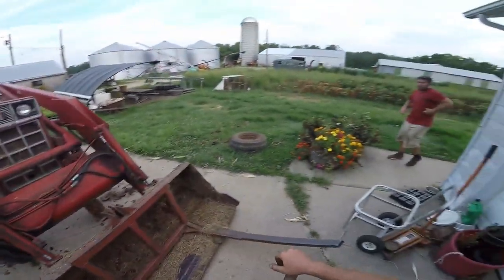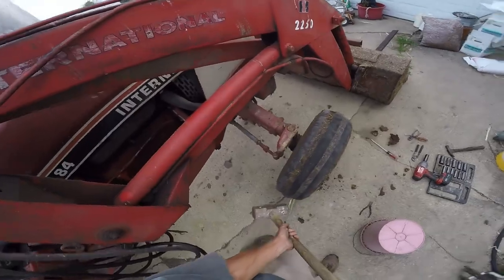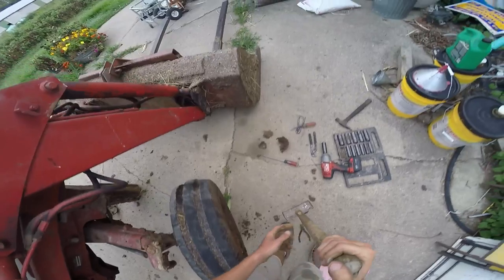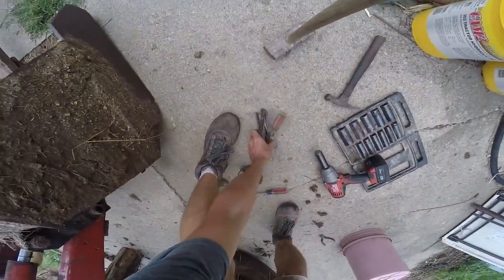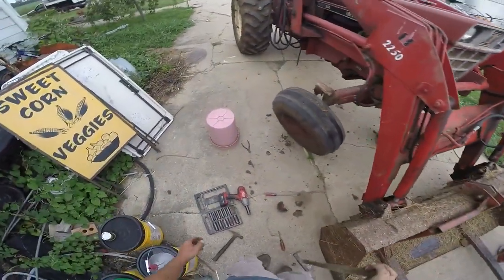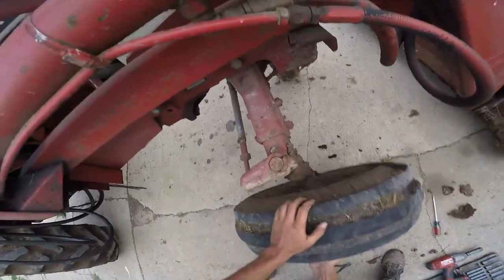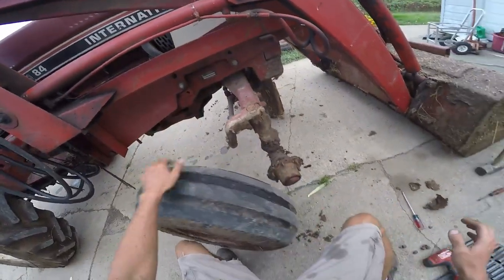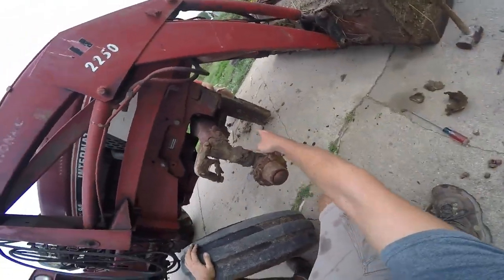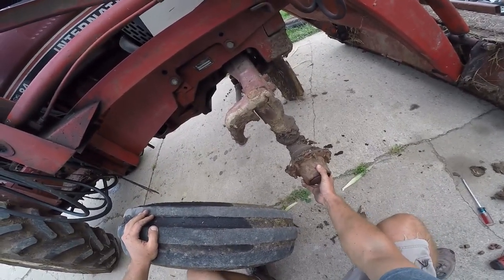I got that side - I'll pop the part for you. All you gotta do is do the nut. I've got a handful of plier options and screwdrivers. Between those two you should be able to get the nut and the cotter pin. Now the greatest thing about having a loader tractor and doing wheel bearings is the tractor has a built-in jack. We did put a block of wood in for safety just in case the loader starts to sink - yeah, that's bad.